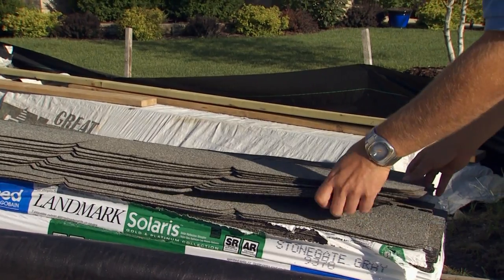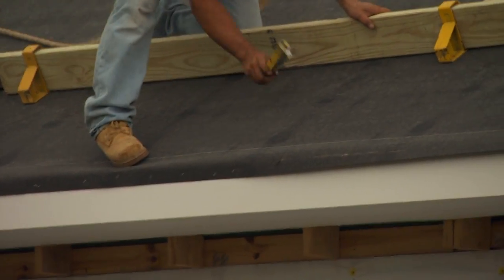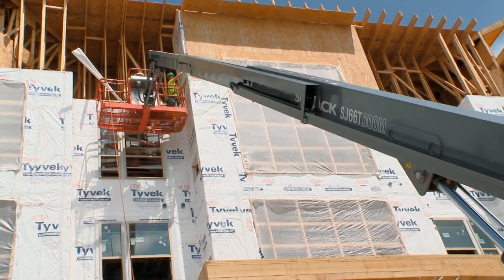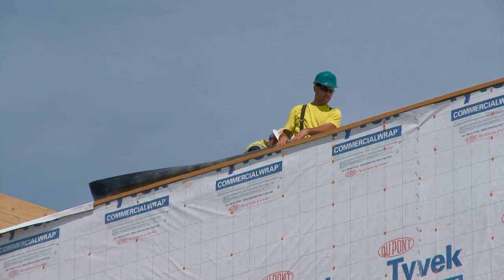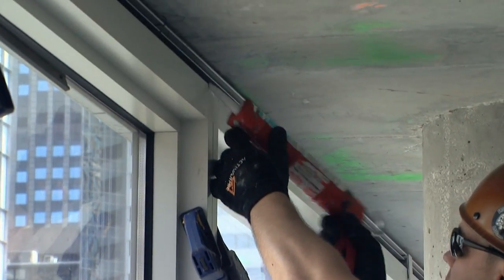We've talked about five sides — the four sides and the bottom. And then the roof: it's the same thing. You've got a water layer, some kind of thermal layer, and you're controlling air from getting up into that roof. The roof really becomes an extension of those elements, and it all needs to tie together. I think that's one of the common problems in construction — you've got all these different elements, but they've all got to marry together. Continuity is the term we always use, talking about envelope integrity. The air barrier in the wall has got to tie to the air control system in the window and back again — and that's got to go around all six sides to keep the inside in and the outside out.